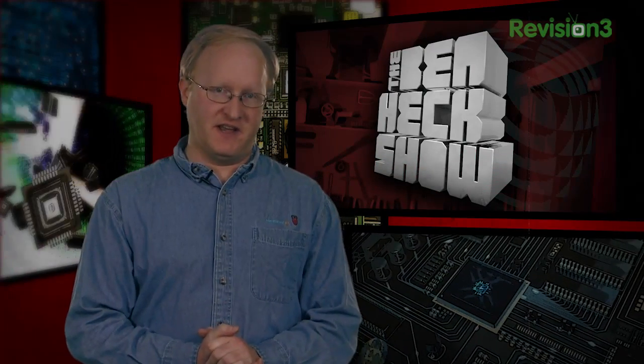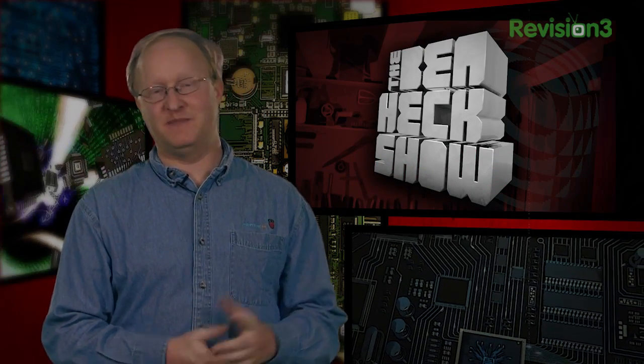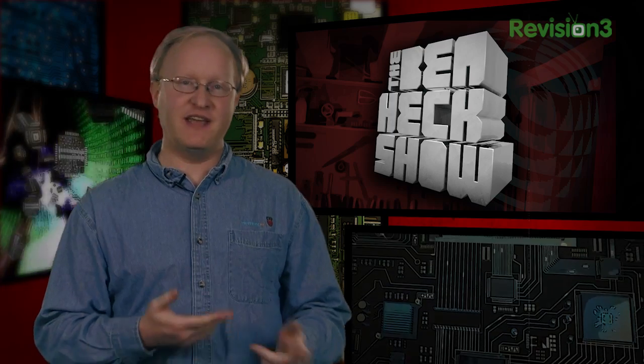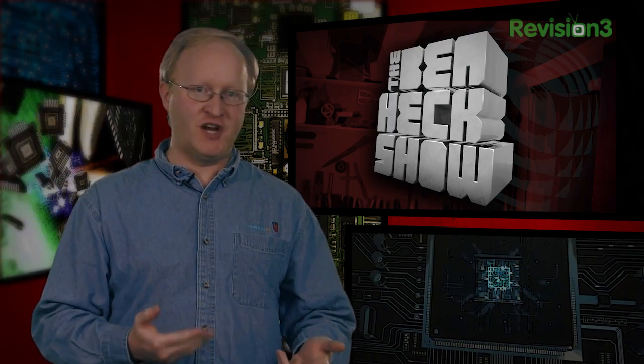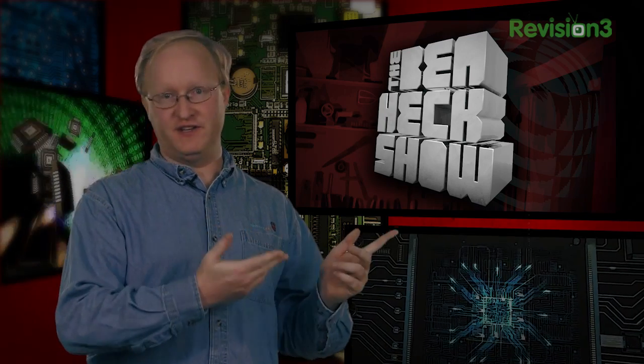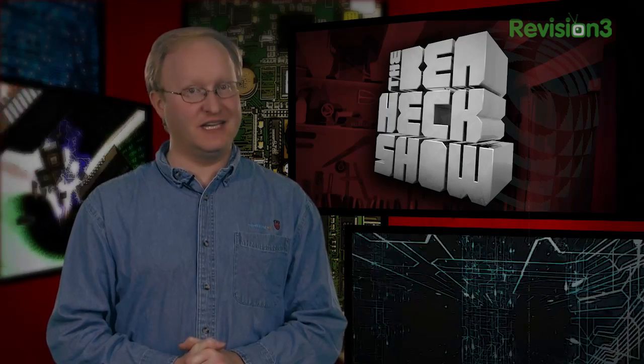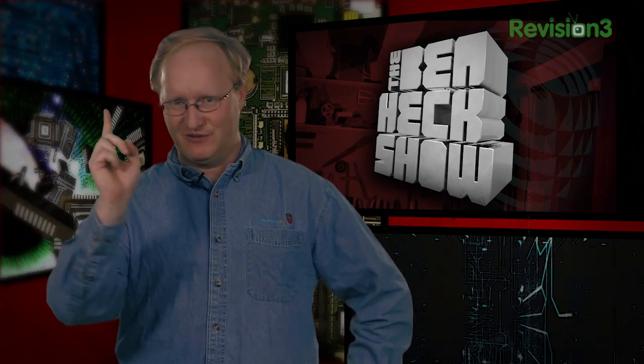To recap our findings today: using an old LCD screen from a random device can be very dicey. When repurposing LCDs, you should look for the following: external inputs such as AV-in on a portable DVD player; a common generic usage like a car backup camera or rear DVD screen for the kids; and well-known parts like the LCD from a popular smartphone or gaming device. You should avoid cheap LCDs because you'll have a hard time finding data sheets, and small devices because you probably won't be able to solder them by hand. The LCD we hacked today certainly hit that second point, and that's why I had trouble with it. Thanks for watching. In our next episode, we'll show you how to get started using CADSOFT Eagle circuit board layout software.